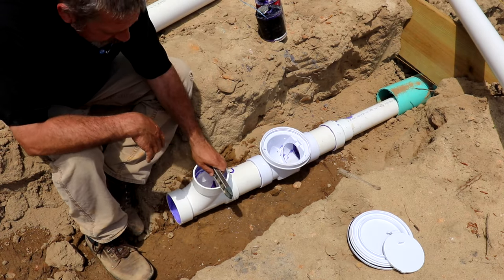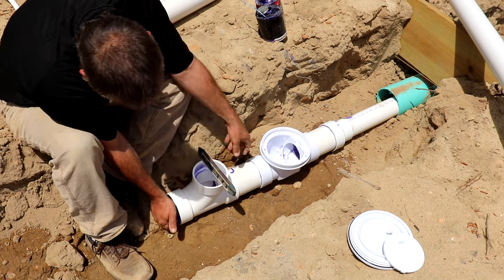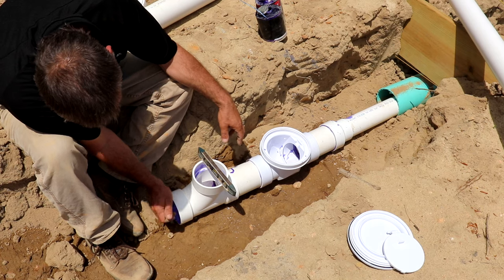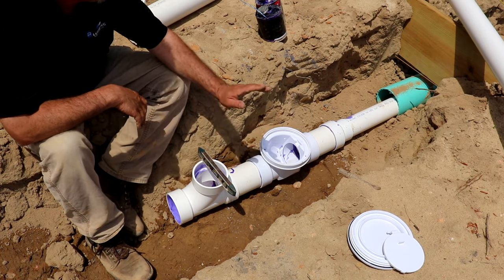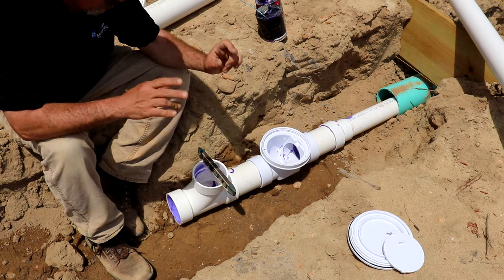You're gonna want to check this one too. You don't want your clean out sticking up like this or like that. You want it pretty close to being level. And then of course, check your fall heading that way.